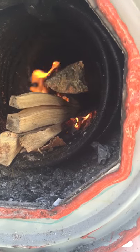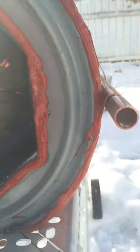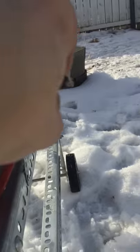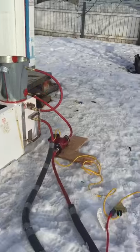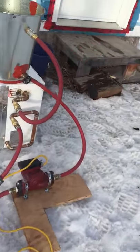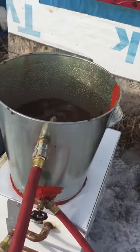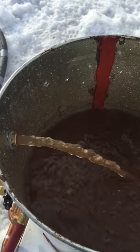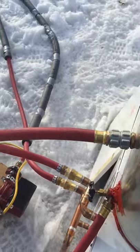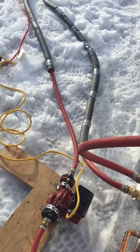The rest of the boiler system is the same as it was in all the other videos. There's a $26.99 Grundfos circulating pump and an old fan coil from a boiler tear-out, with the fan coil sitting outside in the yard today because it's a nice warm day. It pumps through this bucket up here, which is just expansion tank and water makeup all in one. Basically it gets pumped from this bucket to the boiler, back from the boiler through the heat exchanger, out of there into the bucket, and back around again.